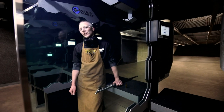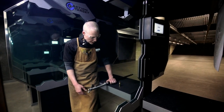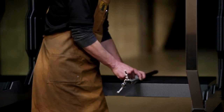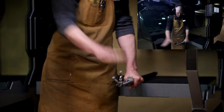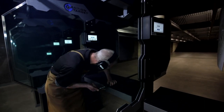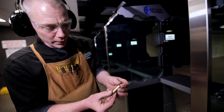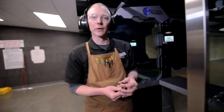Here we are at Lyman Gun Company's 25-yard indoor range. We're going to do a test fire on this just to make sure the chamber looks good. We've just got the stock trigger on, and in this case we don't have the stock yet, so we're just going to shoot it like this. It extracted real nice. The case wall looks perfect — no scratches, dents, or mars. Primer looks good, there's no pressure signs. Looks like this chamber's great.